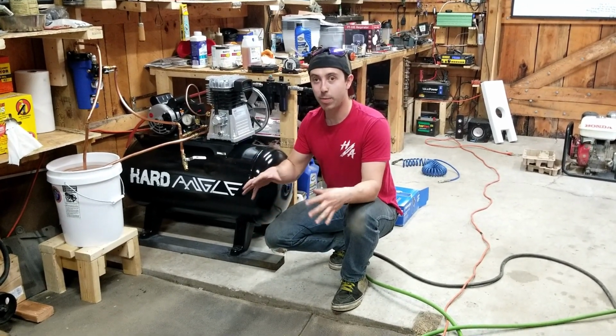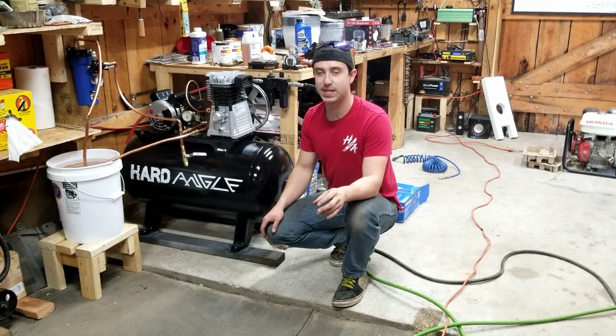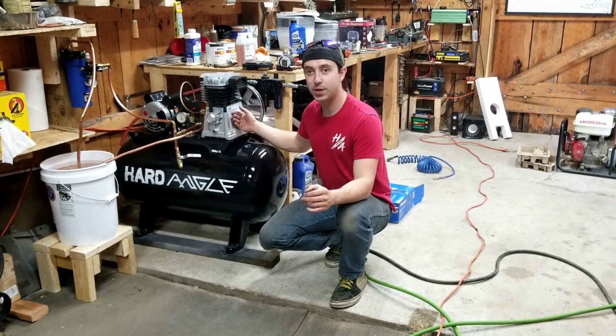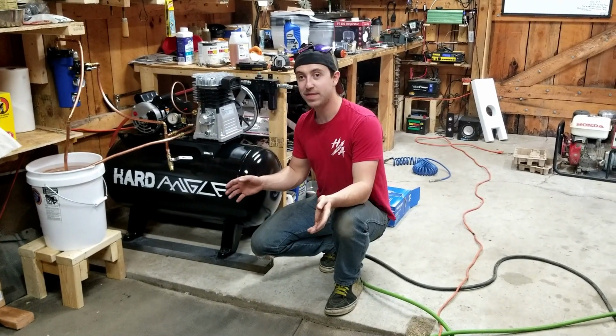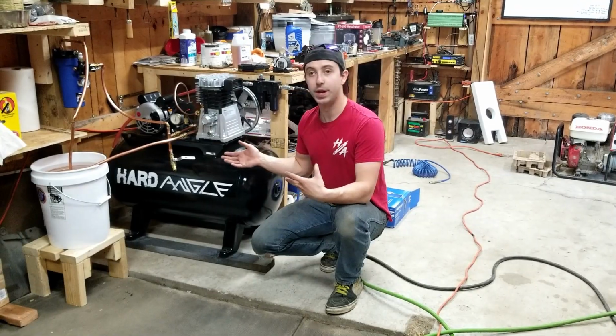The red little PowerMate 20 gallon I was using was on the way out. It used to be kind of okay, but it was getting really slow. It's an oilless compressor, so it was clearly killing itself from me running it for 40 minutes straight. This thing has 100% duty cycle. It keeps up with the sandblaster perfectly. At the end of the day, it was a lot more expensive than I expected it to be, but it was worth every penny of what I put into it.